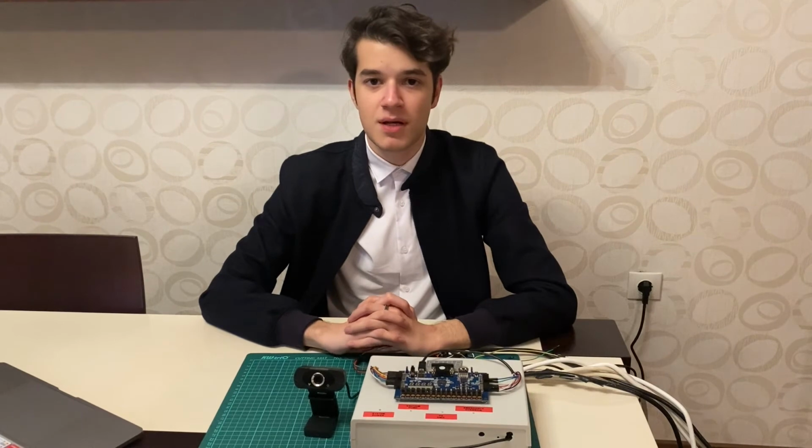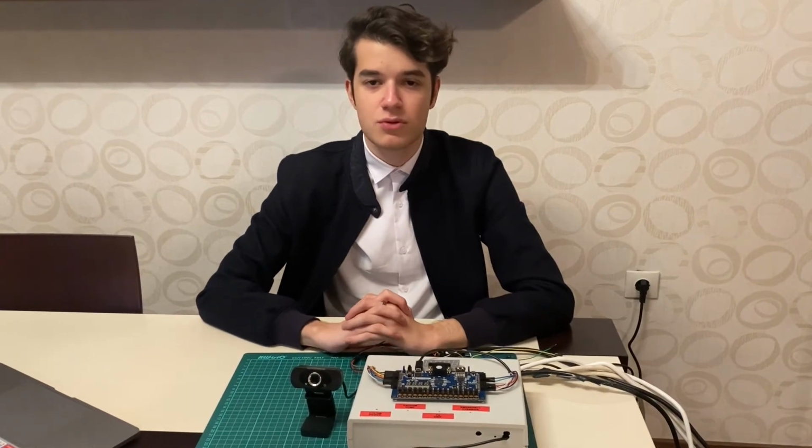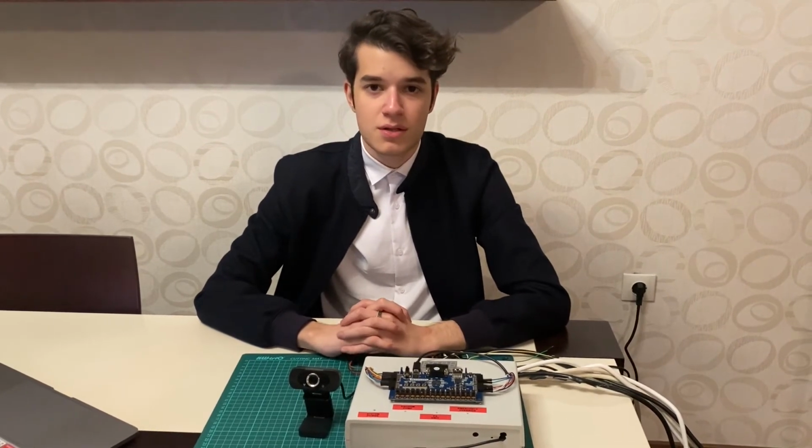Finally, to implement my design in VHDL code, I've used four modules. The first one is the top module, which sums up all the inputs and outputs of the submodules. The second module is the debouncer module, which is used to invert the signal coming from the LDR module and at the same time reduce the noise.